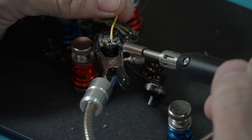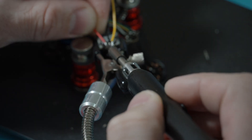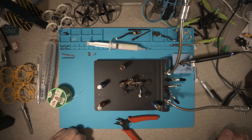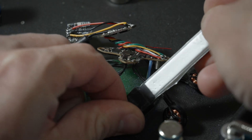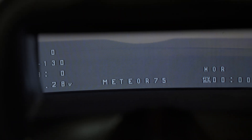Since it is only known that the Aquila 16 had a C02 camera installed, I tried to solder the power, ground, and video wires the same way as on it. But like I said, it didn't work. I checked the camera on another working VTX as well — the result was the same. Good thing I had another camera.